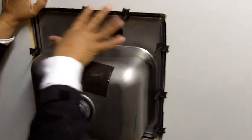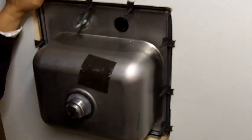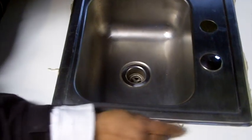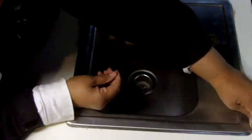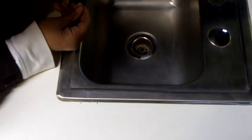I've got my clips in place, they're all tight. It's a smaller sink so I only went with two clips in the front and two clips in the back, but I've got three on the side — it's nice and secure. I've got a little bit of plumber's putty coming out of the side; we want to just clean that off and go around.